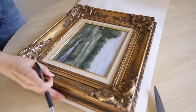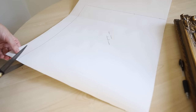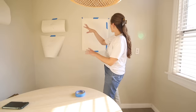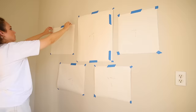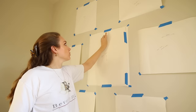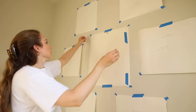The easiest way I've ever done a gallery wall: use some paper, cut out a template of each frame size that you have, then tape them up onto the wall. Arrange and move them around however you want, then it's really easy to add the nails and hang the gallery wall. Write on each piece of paper exactly which frame it is so you remember — for example, 8 by 8 and a quarter, so 4 by 4 and an eighth on each side, then two up and two down. Once you have the final placement, you can mark exactly where the hanger is on your picture so you can measure, mark, and it's exactly in the center. I'm going to use indoor multi-surface screws instead of picture hanging screws — a little sturdier. Then you take off the paper.